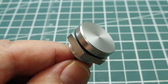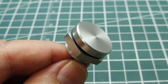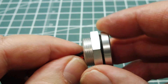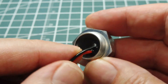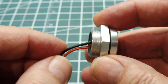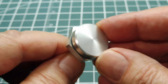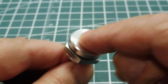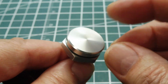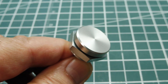In this video, we are going to have a look at piezo push-button switches and how we can interface them to a microcontroller. Sometimes they're called vandal-proof switches because they're one-piece construction. They're waterproof, the electronics is potted inside, and we have two wires coming out — a black and red — so this one is polarity-sensitive. Some are not. It has an O-ring so we can mount this on a stainless steel faceplate. It'll be very strong; if anybody tries to hit or punch it, they won't damage it. We're going to hook this up to a microcontroller and demonstrate how this vandal-proof switch works.